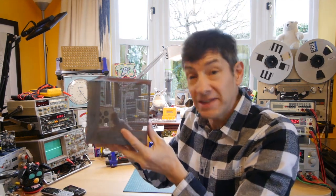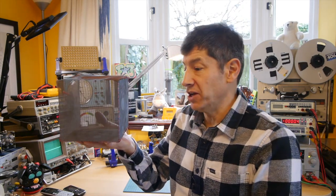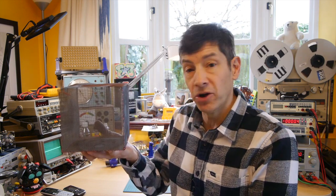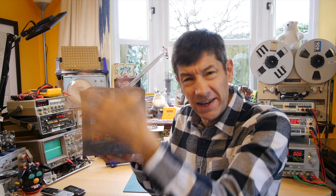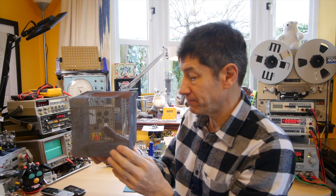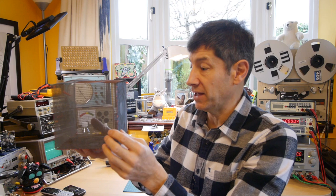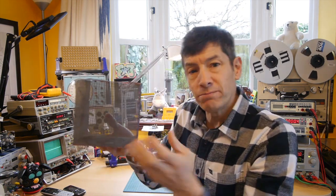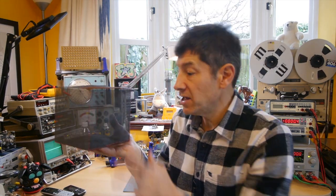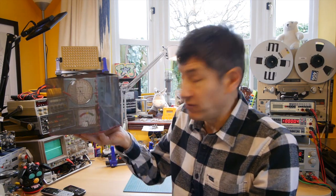So let me attempt a fairly simple explanation of how the Faraday cage works. The first thing you need to know is the Faraday screen is a bit more like the barge that I was in on holiday — that's a metal box that's completely sealed. Whereas the Faraday cage, which works in a very similar way and is used for the same sorts of things, is made of mesh. Which would make you think that electromagnetic radiation could get through the holes. But the important thing is you need to make the gaps in the holes smaller than the wavelength of the electromagnetic radiation.